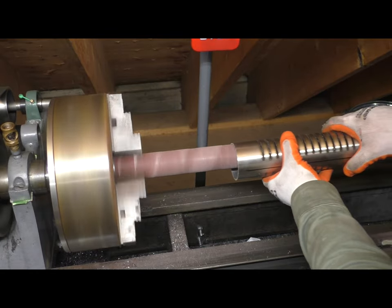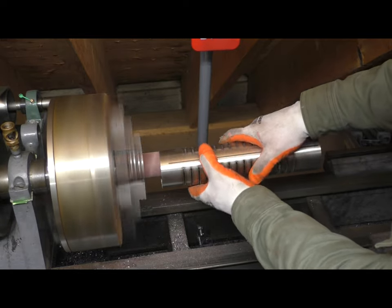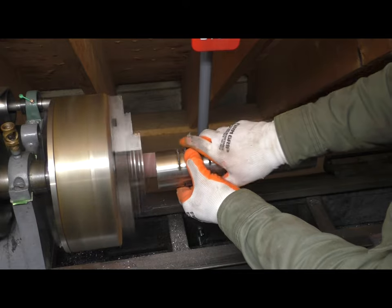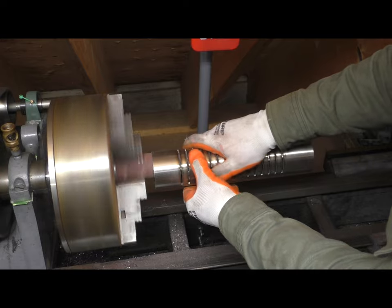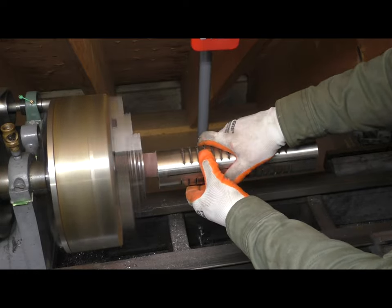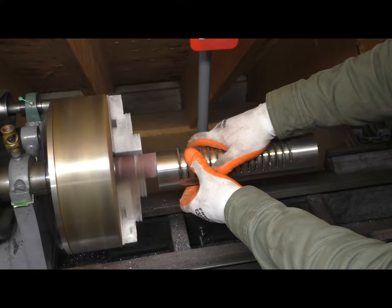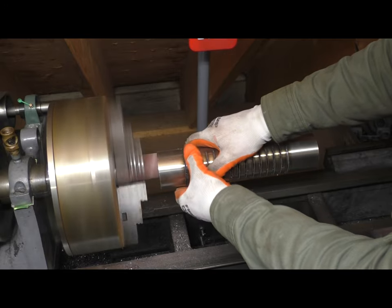Whenever you use an abrasive blade to cut steel, especially stainless steel, you always end up with that kind of ugly burr on the inside of the cut. That, of course, is exactly what you don't want with anything that air is flowing through. So thinking about that, I decided I really needed to knock those down and make it as smooth as I could on the inside. So I used my lathe with some sandpaper tucked around a tube. Felt a little makeshift, but worked out okay. And again, did a finger count at the end and had all 10. So I call that a win.